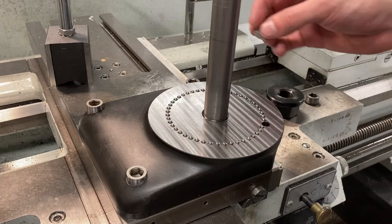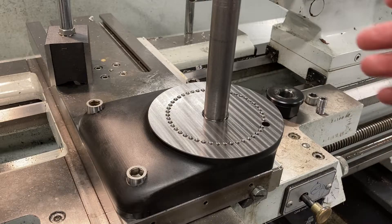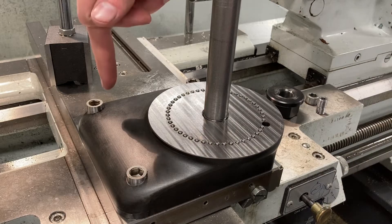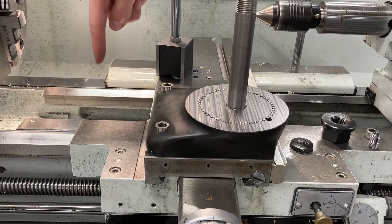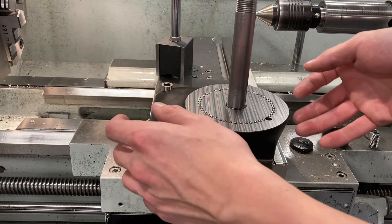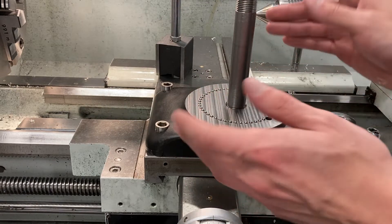Some unique design considerations for this particular post: one, as you can see, the tool post mount is actually off-centered from the middle of the cross slide, and that's on purpose. By having the tool post over here, the loads on the cutting tool are above the dovetail of the way. Previously, with the tool post centered, if you have a parting tool or something, that load out here tends to want to twist the whole cross slide, which is significantly less rigid than having the loads just over the ways going straight down rather than creating a bending moment across it. So not only is it more rigid because the compound is gone, but it's more rigid because the loads are better applied to the cross slide itself.